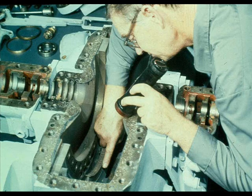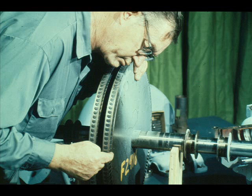Again, as with the nozzle ring, the stationary buckets are not removed from the turbine case unless they must be replaced. The buckets on the turbine rotors must also be inspected very closely for damage or wear. Watch for steam erosion or an excessive buildup of scale in the buckets.